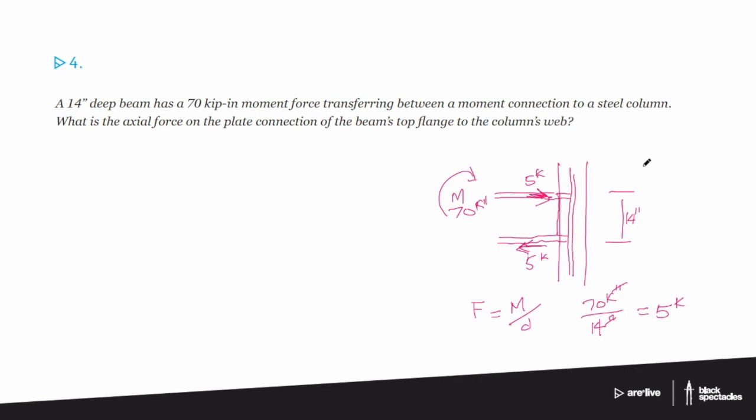So the PhD you're talking about is somebody who has gone through and calculated all those different scenarios. Yep. So I don't mean they're made up numbers, but it's not like if we actually went into this building and tested this, it would be 5 kips. No, it won't be. This is a useful number for designing the building. It's a way of keeping everybody smart and safe, because if you really were going to figure out every possibility, it would take everybody forever and cost an enormous amount of money. Right. So think of it as looking for easy ways to figure it out and keep it safe.